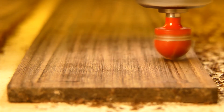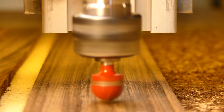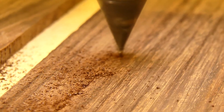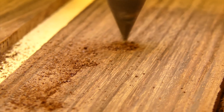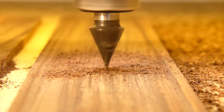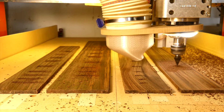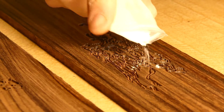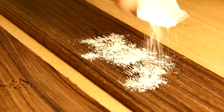I've created a new Fusion 360 project and inserted all four models into the new project. I arranged them and made only the relevant sketches and bodies visible. I created a setup for each fretboard, and a set of toolpaths unique to each. I set the WCS offset for each setup to 1, 2, 3, and 4, which equate to the G54, G55, G56, and G57 offsets. I selected the operations that used the same tool, or logically went together, and post-processed them into G-code files.